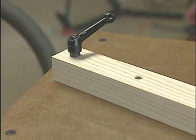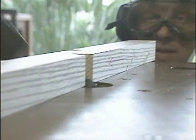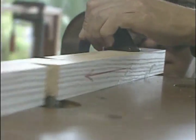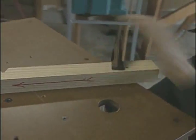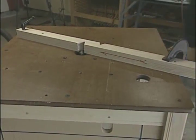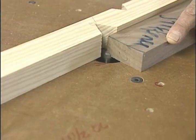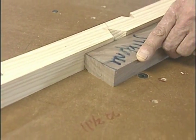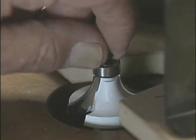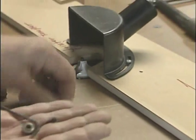This plain one pivots at one end for easy adjustment. It's just a 1 3/4 square stick with a notch sawn from the middle to accommodate the unused diameter of the cutter. The arrow shows the safe direction to feed the work. Clamp the free end after you've adjusted the cutter exposure you need. The fence controls your depth of cut, so remove the bearings on your cutter. They still spin even if they're idling, and that counts against their lifetime, which is only a few hours at most.